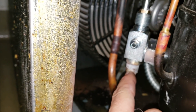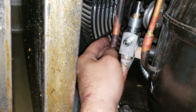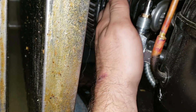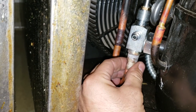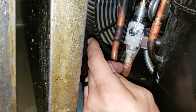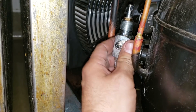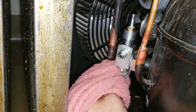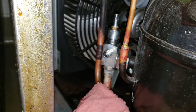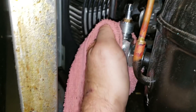Number two: you have to learn how to weld blind. I could only hit this weld from this point and from this point - I was able to get just a little bit from the other side. You have to learn how to turn your heat up. When you go to school, they teach you how to weld in a lab and it's all pretty because you can get to all sides. In the field, lay the solder on there. Now that you learned how to braze in a class, it's time to use some solder, use some heat. Don't be afraid to use a bigger tip - I braze with a number two tip at all times.